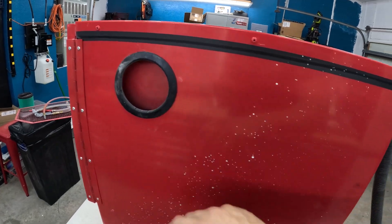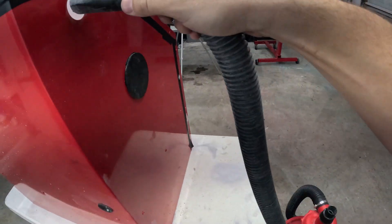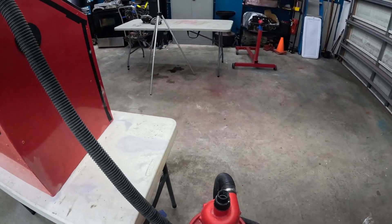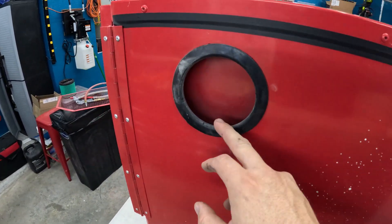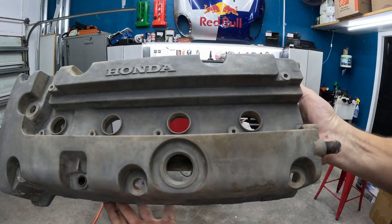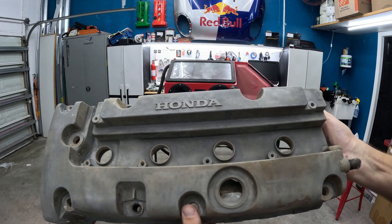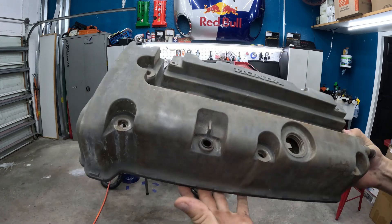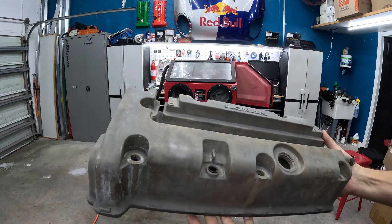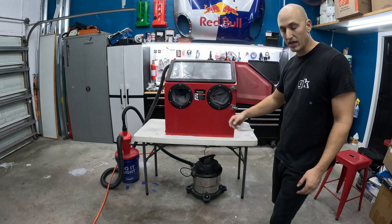Here's the air line feed for our air compressor hose, our fresh air vent, and our dust collector suction port. We've got our dust collector hose — stick it in there and fire up the vacuum which is hooked to our dust collector when we start blasting. Fresh air gets sucked through here and all of our dust goes out and gets collected into the bucket. This part isn't the worst — we already blasted it once, then put it in the oven to bake out any impurities, extra oil, or whatever, which brings it all to the surface. We're going to run it through the blaster one more time to get any last bits of debris out and have the freshest surface possible. With a larger item, I don't know how much bigger we could get and still use this comfortably. Enough talking, let's get to it.